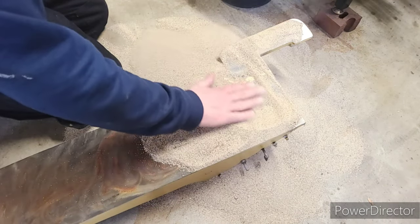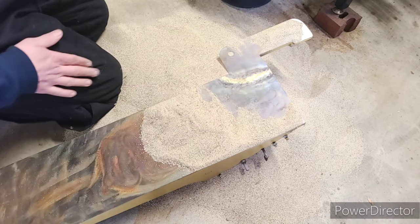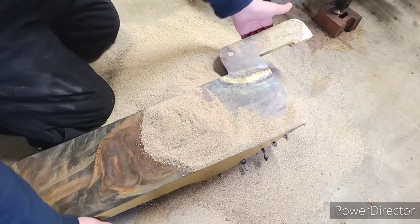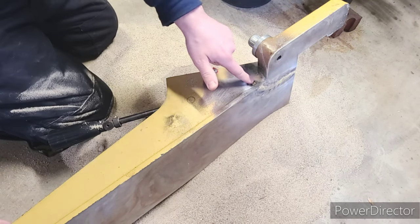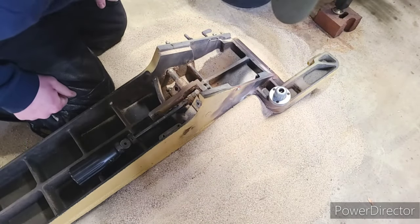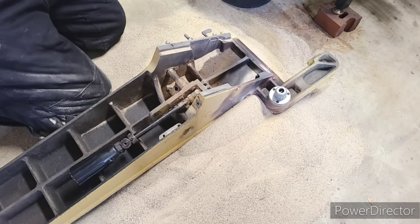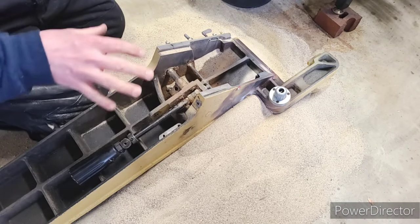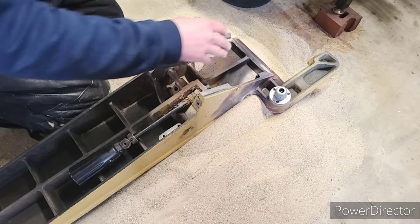Let's look at our braze. As you can see, it's quite ugly, but that's how they look. The crack didn't travel any further — that's good. Let's go ahead and look at it on the side. The crack did not travel down. There's that little spot there that I brazed. Looks good. The crack didn't travel any further, and I can just see some of that braze coming through on this side. Now, if we attempt to braze this side, it is possible that I'll put a good braze on there, but it's also possible the braze on the other side will just melt off or melt through. So for now, we're going to leave this and see what happens.